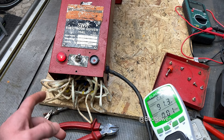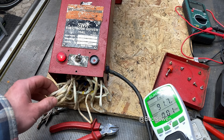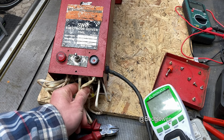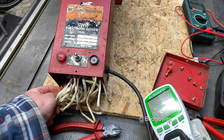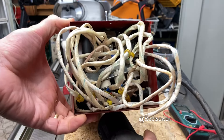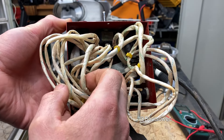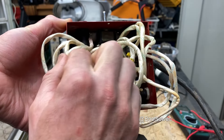I don't know what's going on here, and who knows who's been playing with this before - that's the other issue. I think the thing to do is try and decipher the wiring, so I'm going to have a look at that off camera. It's labeled with different cable ties with different numbers - plus, minus, 120, 120. Down there something says 220. Power coming in - I'll have to trace that. There are four ceramic insulated blocks - I think they're just connectors.